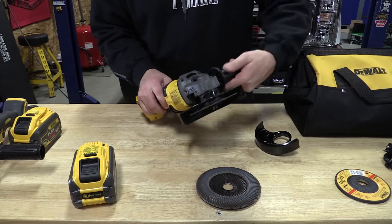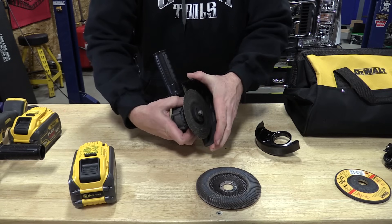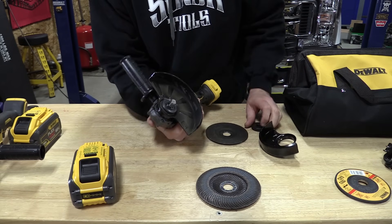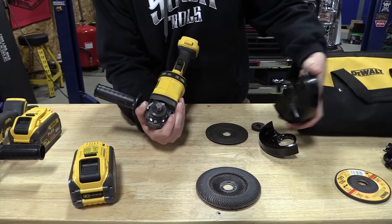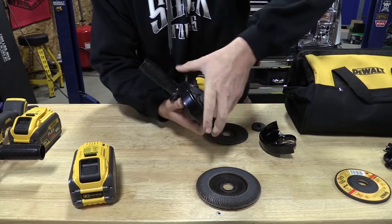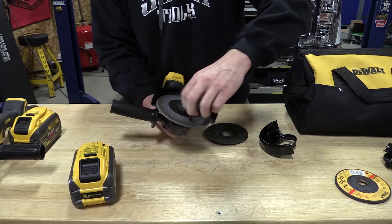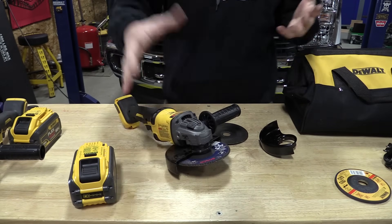If we just take a quick walk around, you do have an auxiliary handle that can go on the right or left. The blade guard is a simple tool-free adjustment — you just push that lever to take off the blade. You have a spindle lock, it's very simple to remove. There is an Allen key if that were to get stuck. To remove and switch the guard, we just pull this all around to the front and it comes right out. If you want to put in the four and a half inch guard, just put a little pressure on it and it will go back in. There is a small piece on both that you have to line up, which can be interesting with gloves.